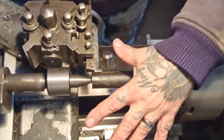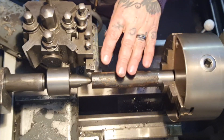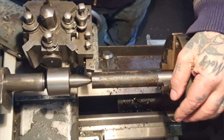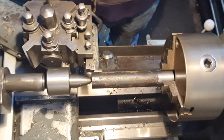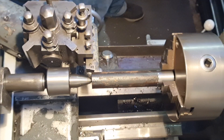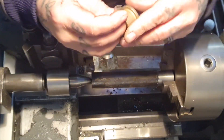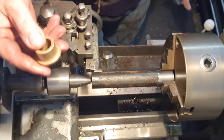It's now the following Monday - I'll probably chop a clip in from this week's vlog to show how cold it is. It's minus one in the workshop. We've got the outers on and we're still at the machine. What I need to do now is take this down - if you remember, it's only a minute for you, it's two days for me. We need to machine this down so that it fits inside these bushings which are going to form the pivot.